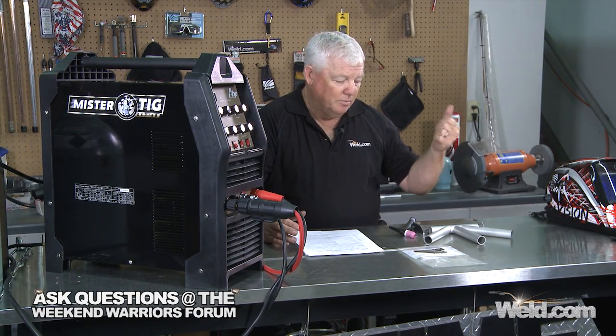Now that you've got that figured out, this all has to go to the lab. Since it's aluminum, magnetic particle testing is out. Typically you're going to get a fluorescent penetrant inspection. All welds get visual inspection — they look for undercut, cold lap, porosity, and cracking is absolutely not acceptable. You'll see category level one, two, and three; level one is the highest stress aerospace criteria and in almost every case gets X-rayed. In many cases I recommend going to what's called class B, which includes visual, penetrant, and the lab will actually cut into it to look at the weld nuggets and check for penetration. Ninety percent of the time you'll want to deal with class B, and that's what we're going to demonstrate today.